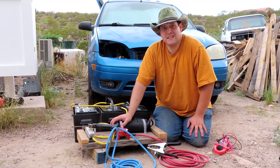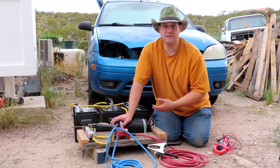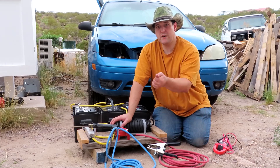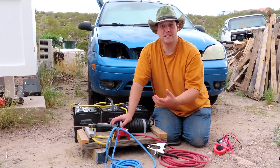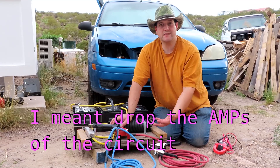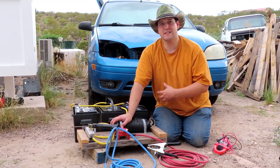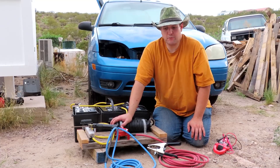What is the inductor doing? When the current gets going, it has to build up a magnetic field around this — that takes some energy, and we're limiting the current as it does it. Once the inductor reaches saturation point, the current can just free flow. However, we're slowing down the flow of current enough that once we do that first initial grab — where the spark goes, we cause the short circuit, the arc forms, and we get a plasma arc effectively. That arc takes a lot of resistance and power to run it, so it drops down the resistance of the circuit, and we stabilize around 200 to 250 amps, maybe as high as 300. My clamp meter just can't measure it effectively because it's moving too quickly — I'll need to get a shunt in here to measure it directly.